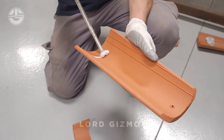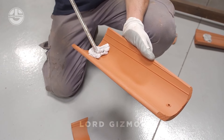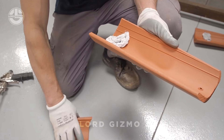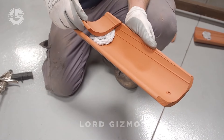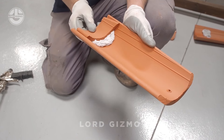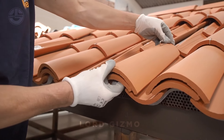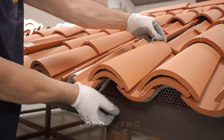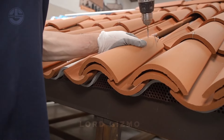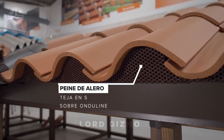Well, according to its specs, the Varela roofing system has been tested to withstand winds up to 110 miles per hour, making it more robust than you might think. The interlocking design of the tiles helps keep everything secure, even during extreme weather. Installation typically involves laying the tiles on a prepared roof deck with proper underlayment to enhance weather protection. The clay tiles are then secured to the roof using special fasteners, ensuring a durable, stable setup.